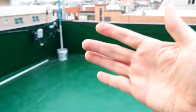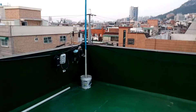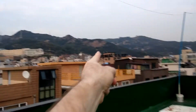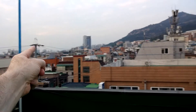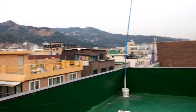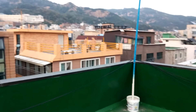What I want to talk about now is that I'm building, hopefully, a wire Yagi. This Yagi will go from the PVC pipe here — the director wire will go directly to the other one. And I kind of lucked out: that distance is within exactly four inches of being the perfect length for the driven element for my Yagi.